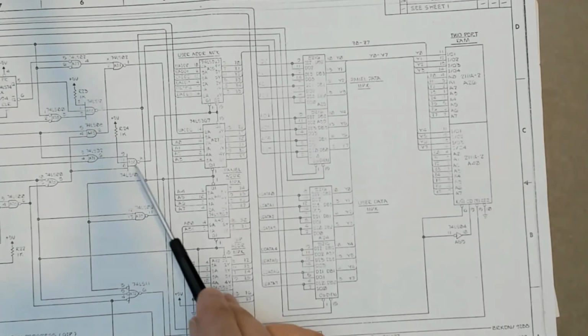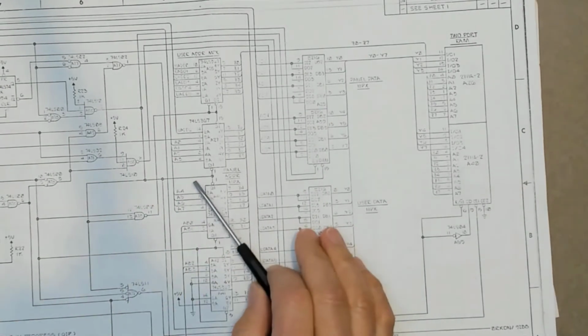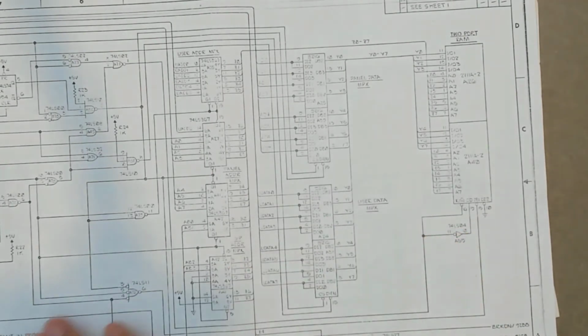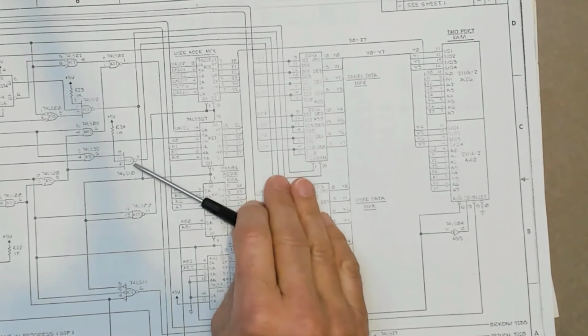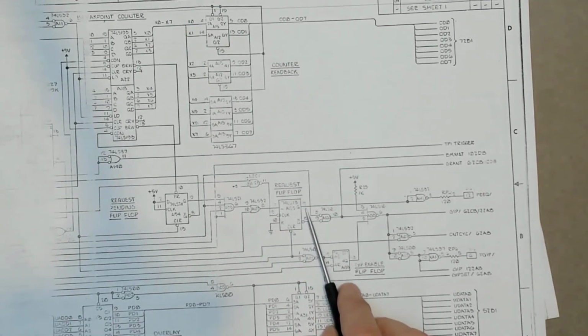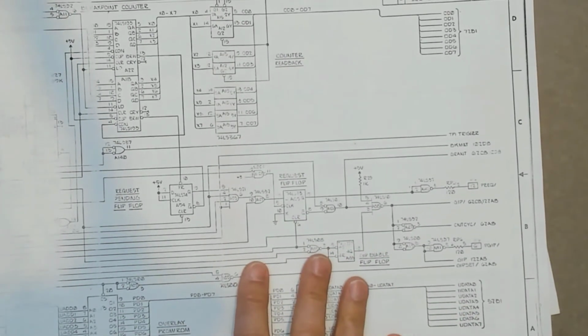There's another gate in this circuit that is going to completely make it obvious that the viewer was right. So before getting my dander up over the viewer's comment, it's high time to go back and look over these entire schematics and figure out the motive of Intel when they put these resistors in. So if we look on page 9, this is where it's going to become obvious. Intel was thinking on a higher level, and these pull-ups are indeed not for protection, but are there for diagnostics and testing. So what on page 9 makes this so obvious?